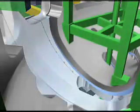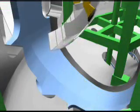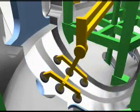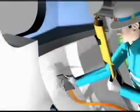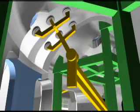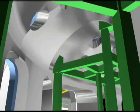Once the last TF magnet is thus positioned, insertion of various shear keys, preloading, final positioning, and magnet axis datum setup continue. Once TF assembly is completed, the vacuum vessel thermal shield of the last sector is installed. 24 small parts for vacuum vessel temporarily stored in the vacuum container are installed in their position by a robot, and a vacuum seal is established by welding.